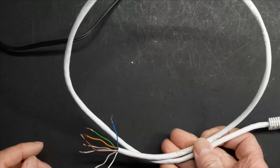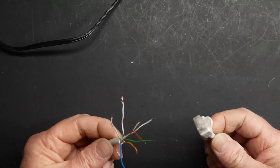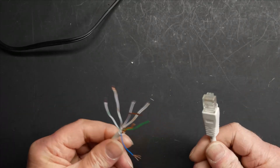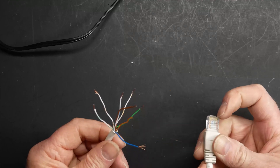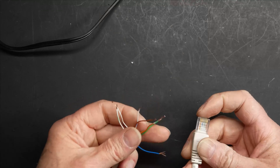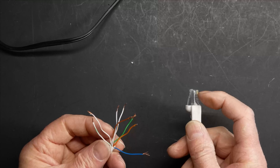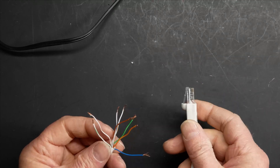The first thing I did was use an ohmmeter to pin out the cables, because from what I found there isn't really a standard on this stuff. So I put something sharp on the ohmmeter clip, got down in here, and pinned out all the wires to find out where they go. In the radio, this will be pin 1, 2, 3, 4, going down to 8.